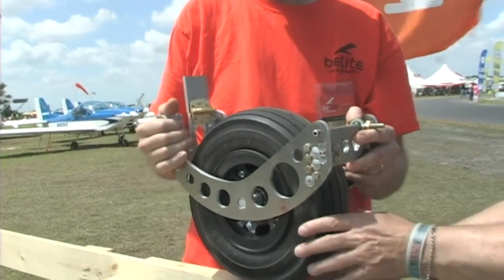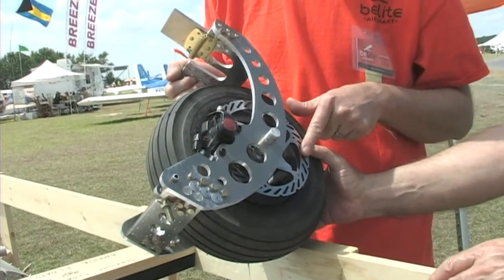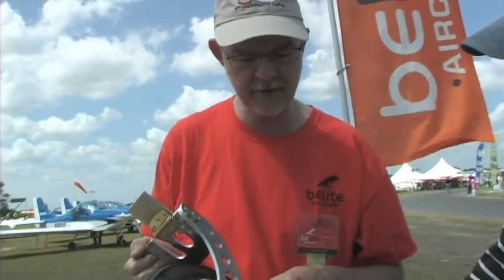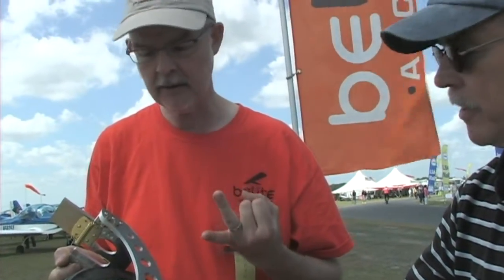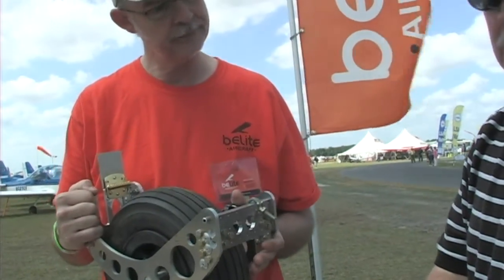On this side you've got a brake — that's a stainless steel brake. For ultralights we've had perfect performance with heavy-duty mountain bike brakes, and that's exactly what this is. Mountain bike manufacturers want to keep things light, and they deal with the same problems — mud, water — so it's a perfect match for an ultralight float. For the bigger float versions we'd use a different brake.